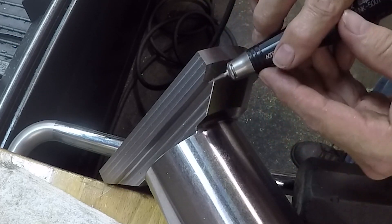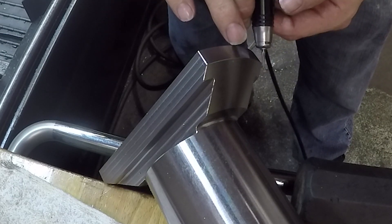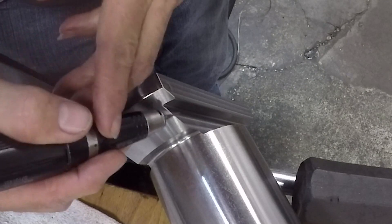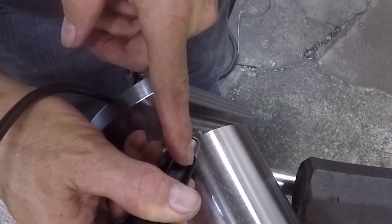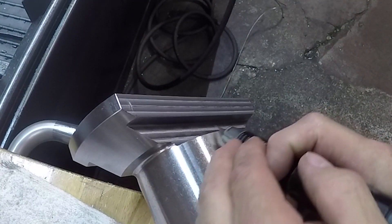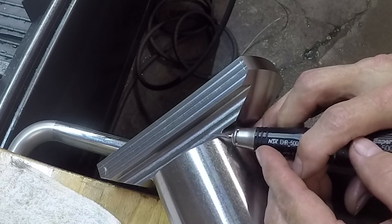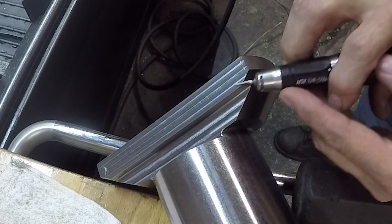It's not too difficult, but it can take metal off pretty fast — I think it's turning at 40,000 RPM with a little carbide tapered burr with an eighth-inch diameter shank. I resisted buying this thing for a long time because it's kind of expensive, but I've had it for over 10 years with no trouble at all. It's a really nice tool. You just twist the end of it and it releases the collet — no wrench needed to change the burr. It's a constant torque brushless motor with quite a bit of power; you can put a big cutter in and it still has power to turn it.